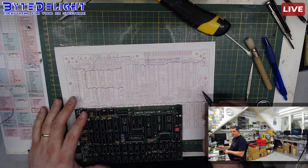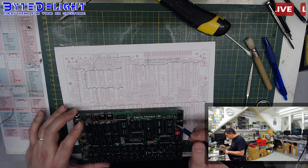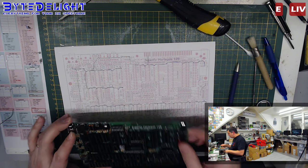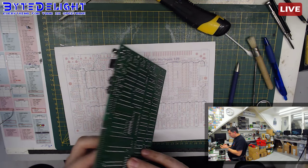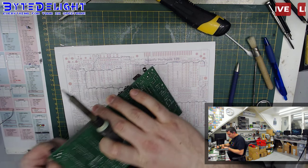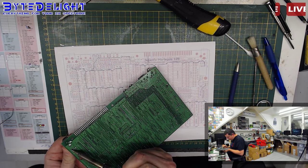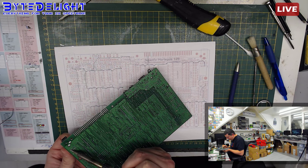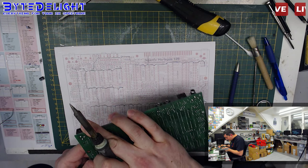Thanks, man. No, I did check if any component didn't get warm. So we only have this capacitor and those two 100 nanofarad capacitors. And those are the only 3 parts, of course, except for the regulator, that are still on here. And it could be this capacitor, the 22, I think, 22 microfarad. But they're from an A brand, and I never had this situation before, so it would surprise me. I like troubleshooting as well, but it is time consuming, and I really should make money instead of only troubleshooting, you know. So we removed that capacitor.